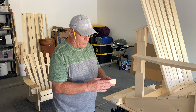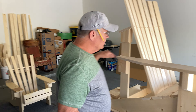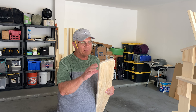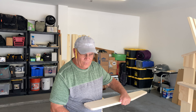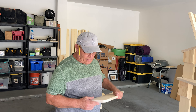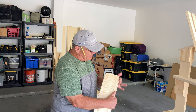After that I went ahead and made my cuts. My chair arm was pretty simple. You can use anything you've got laying around that's got a radius on it — anything round, the bottom of a glue bottle, a cup, or anything like that. Place it on the corners of your chair arm and just trace around it. Then I put it on the saw, cut them back at 45 degrees of an angle right next to where I traced, and then just sanded that radius onto it. I ended up with just a nice edge like that instead of just a square edge.